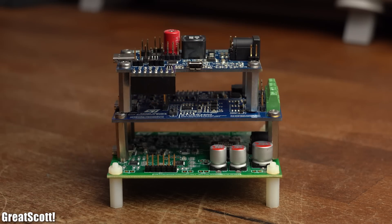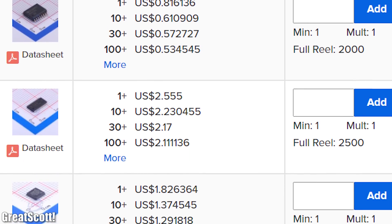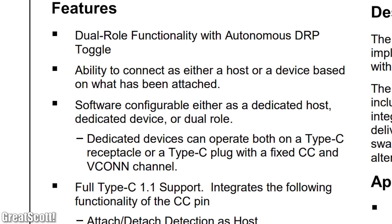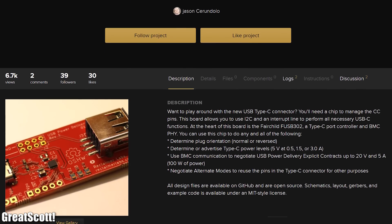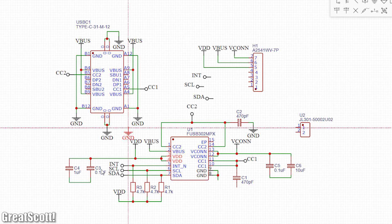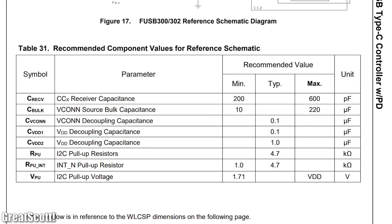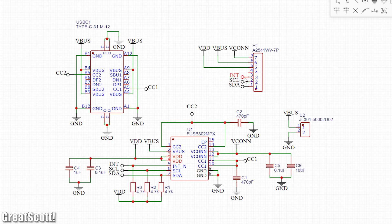Those boards were obviously huge in comparison to the commercial PCB, which is why I started searching for a more compact USB Type-C IC, and what I found was the FUSB302. I chose this one not only because it fulfills all the basic functions of such an IC, but also because other people have already played around with it, meaning I don't have to do the groundwork. First off I needed a PCB for this IC, so I created a schematic — which was super simple to do because the datasheet gives us a reference schematic with recommended component values. All I basically added was a screw terminal for the bus voltage and male headers to break out the I2C interface.